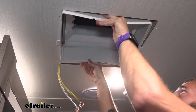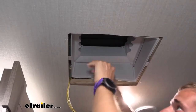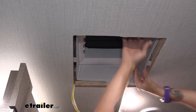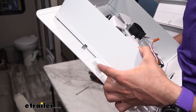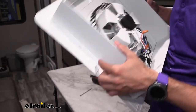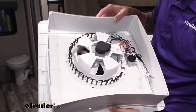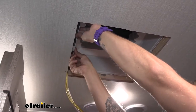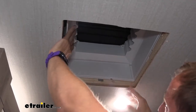I'm going to go ahead and put my inner trim piece back up in here, making sure I get it locked into the top so our screws line up right. While I was pushing this in we had some issues with spacing because these tabs are hitting right where a stud is, so I'm going to cut off just the two on the sides so it sits flat — this has to actually meet flush, and with tabs sticking out the vent wouldn't slide up into place correctly. Now with those trimmed, the remaining tabs are sliding in between the boards and also helping hold it in place.